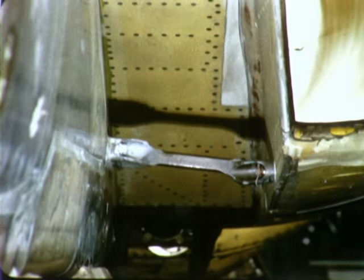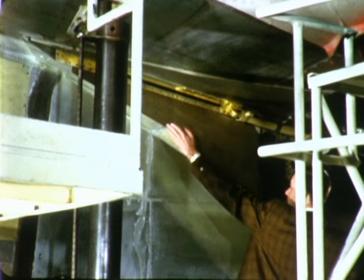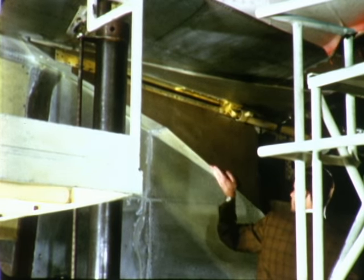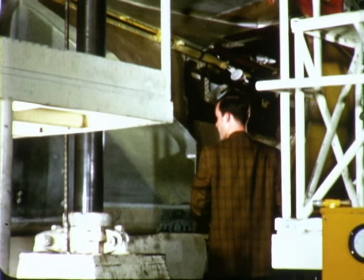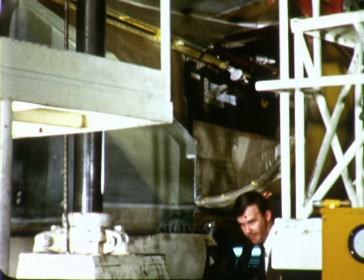Like Triple Plow 1, Triple Plow 2 uses low angle ramps or plows to divert much of the boundary layer around the inlet, thus minimizing the internal drag associated with ducting boundary layer flow through the airplane.